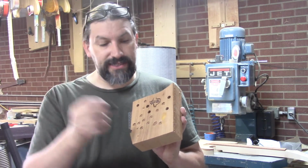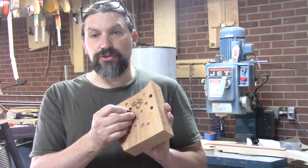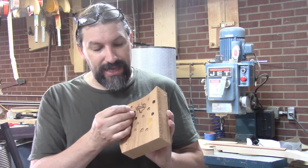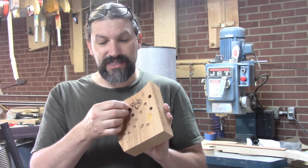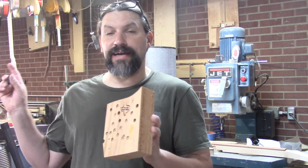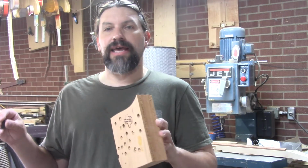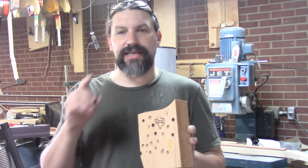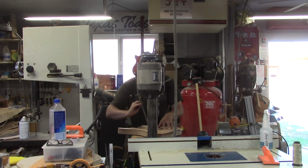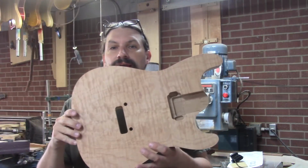So in this case, the stud that we got from the Floyd, 3/8 is a little bit too small, 13/32 is a little bit too big, 25/64 looks spot on. So that's what we got. The bit is chucked up into our drill press. It's a brad point bit, and we are going to drill holes for the body right now. Okay, so there we go.